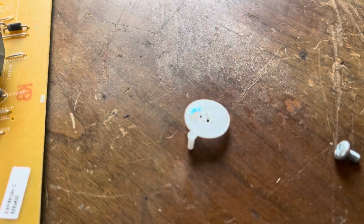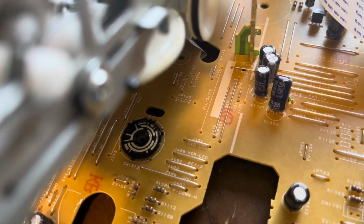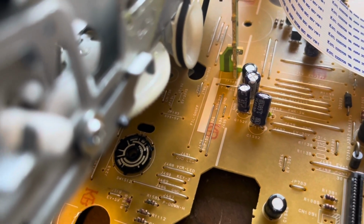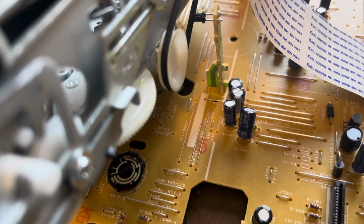So off camera, I went ahead and popped the contacts off. And you can see there it's a little bit oxidized right there. And also we've got to remove that dielectric grease and clean that. It's not as bad as in there. I've seen them a lot worse, but we're going to clean that up. You can use 99% alcohol, or you can use, of course, DeoxIT and stuff like that, and just go in there and clean it up with a Q-tip.